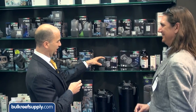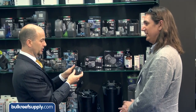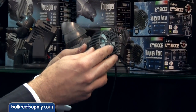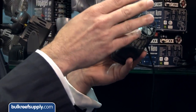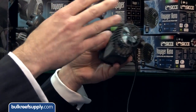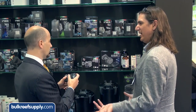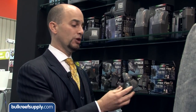Can you tell us a little bit about these Synchras? Yes. The other thing — this will also be available in one version that is DC. DC as well? You'll have a DC version of this that has variable speed. It has four different preset settings, and then it ramps up from 100 gallons per hour to 2,200 gallons per hour and does all the surging and preset controls that people are accustomed to. Is it also going to work with aquarium controllers like the Apex? Yes, it will be Apex controlled. That was a big hit. And then after that, we will come out with our own controller that runs four of them.